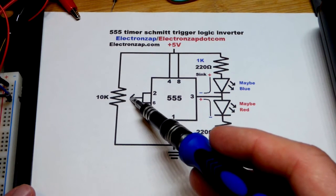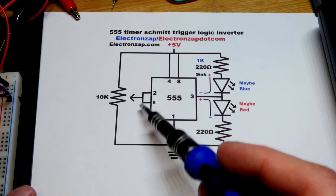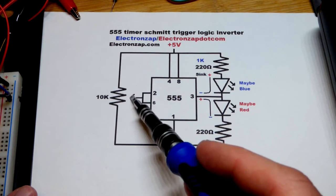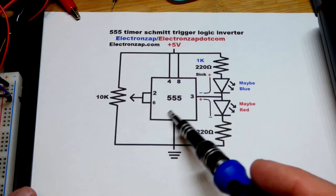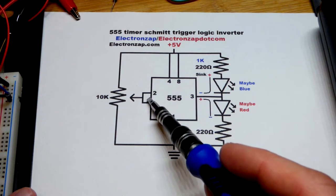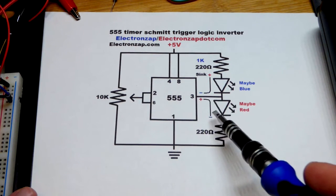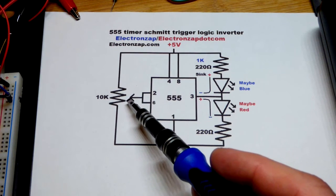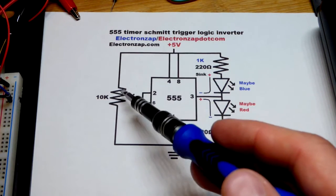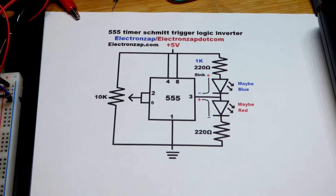I'm going to set the power supply to 5 volts. If we put the trim pot all the way down to the negative rail, we'll have 0 volts. The inverter part: if we give the input 2/3 of the power supply voltage or more, pin number 6 will detect that and we'll have a low output. If we have 1/3 or less of the power supply voltage, pin number 2 will detect that and set the output high. From 1/3 to 2/3 — that middle range — it's going to hold whatever state it was last put into. That's what makes it a Schmitt trigger. It doesn't have a specific point that it changes; you have to overcome a lot of distance in either direction for it to change.